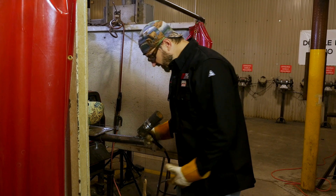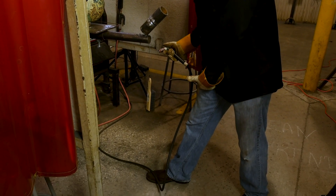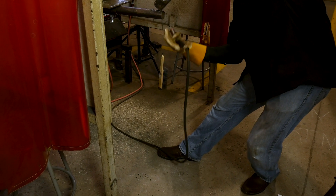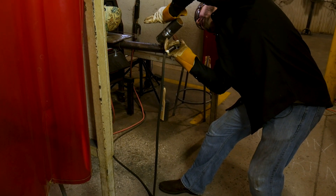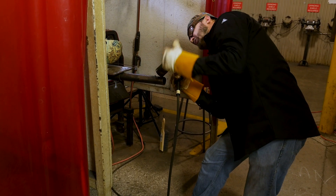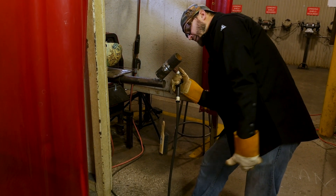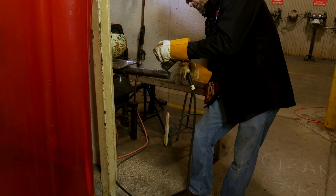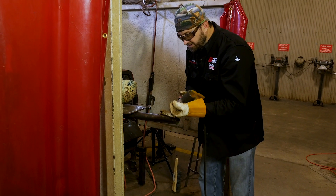So how I set up: I put my right leg forward and my left leg back. Then I lean my weight back onto my left leg. That extends my right arm out to where I can bring it up underneath here, bring my wire in from over the top. And then all I've got to do is just rock it back and forth as I'm going around my pipe. As I come up my pipe, I transition my weight from my left leg onto my right leg and bring it up to me, bringing my left leg up to my right leg. That allows me to stand up nice and smooth and come right over the top of it and make the weld.